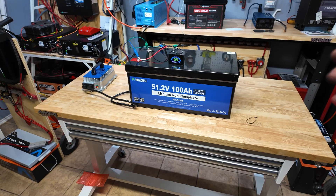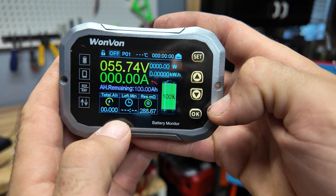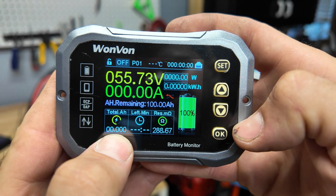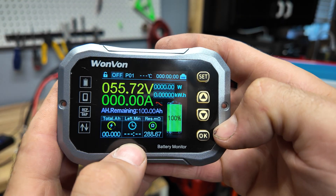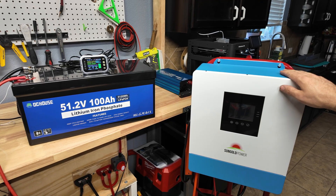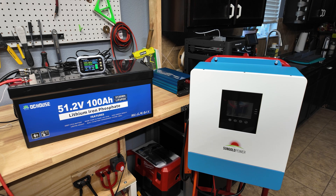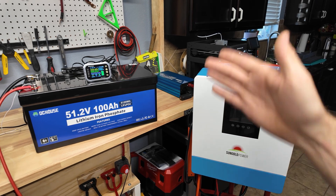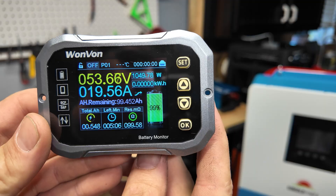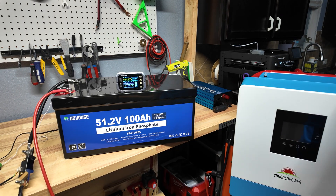We've got the DC House 48 volt battery fully recharged. I reset the shunt to 100% and cleared our total amp hours, so when the capacity test is finished that will be our total. We're at 55 volts hot off the charger and the app shows 100%. To capacity test the battery we're using a Sun Gold Power 48 volt 5,000 watt inverter, plugging in a mini-split AC in my garage that puts about a 1,000 watt load — that's 0.2C for this battery, and should run it for about five hours. We just concluded the discharge test and got a total of 104 amp hours.